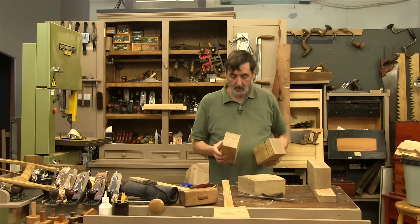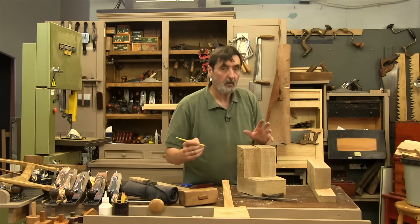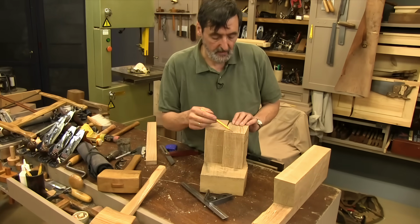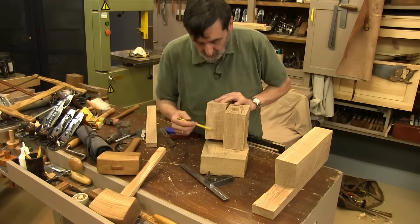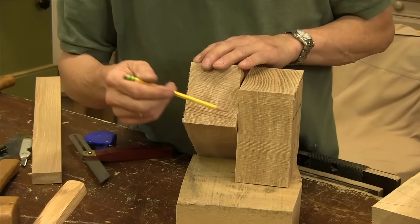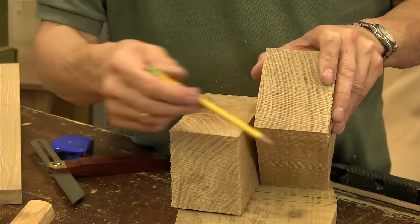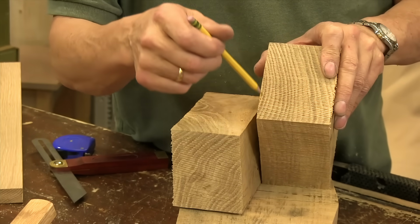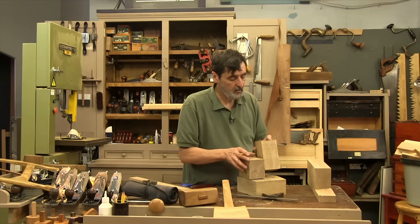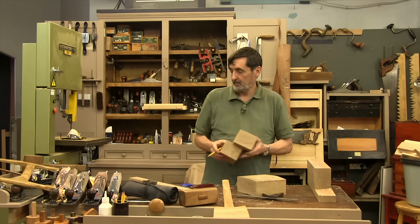I've got 2 here. I don't know what would have happened in here. You can see one of the nice things about working wood this way is you get this nice even surface. You can see medullary rays on both of these pieces, I think, here, going across. And that's because we cut square across the circular annual rings or growth rings in the wood, and that gives you that figuring. Not going to be much good to us on this mallet head, but still pretty.